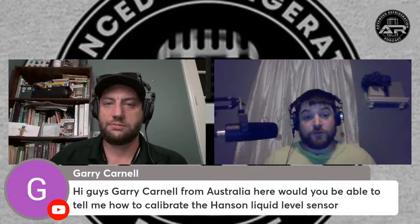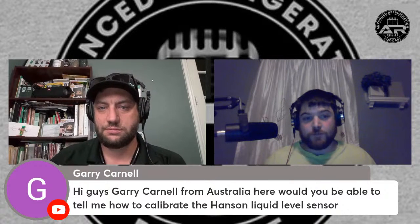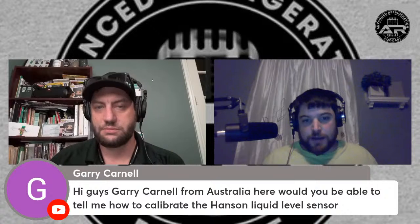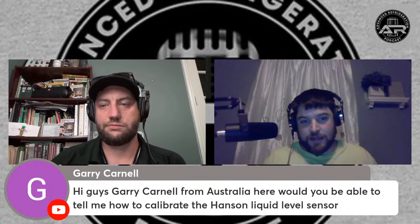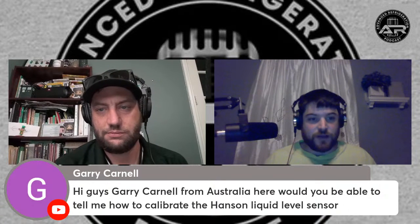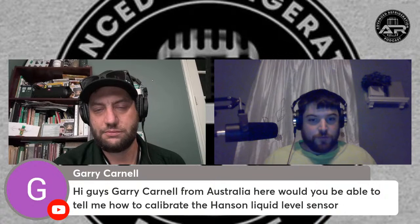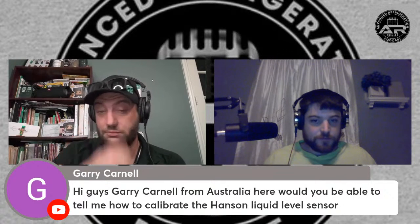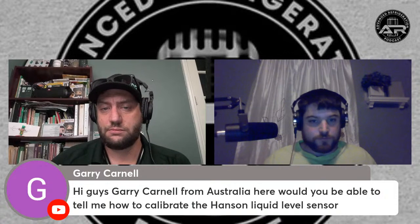Because we had this at another store. The guy went there to replace the rod, and it was doing the same thing. It wasn't reading right. It was erratic. And this is the first thing Hansen asked me, if there was Teflon tape on the threads. It actually kills the ground on the threads. He had enough Teflon on there. They want you to use Loctite, or they use a pipe dope.